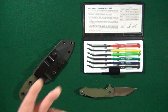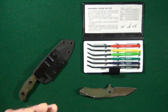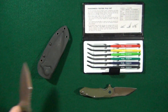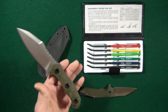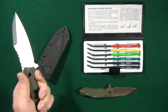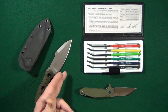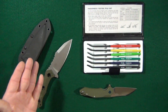When it comes to purchasing knives, a high Rockwell hardness is not necessarily the best thing for my uses. Am I going to want my fixed blades to have a 65 HRC? Not necessarily — especially if you're halfway through a camping trip, your fixed blade goes dull, and you need to sharpen it. How long is it going to take to sharpen a blade with an HRC in the upper 60s? Probably quite some time.